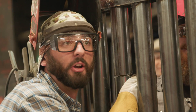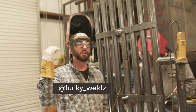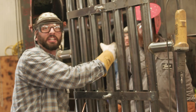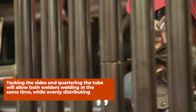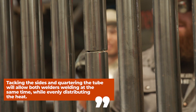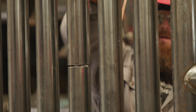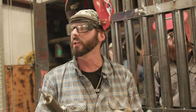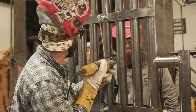When you find a good partner, never let them go. My good friend Lucky Wells — he welds in tubes and boilers his whole life — when you find your partner, you stick with them. For tacking these tubes, I tack mine on the sides. That way I can branch off it, meet in the middle — left hand, branch off it, meet in the middle. He's doing the same exact thing but opposite of me. If I light on this quarter, he's got to be lit on that quarter. We also use a die grinder — it puts off a lot of hot metal chips, so I always make sure he knows before I grind.